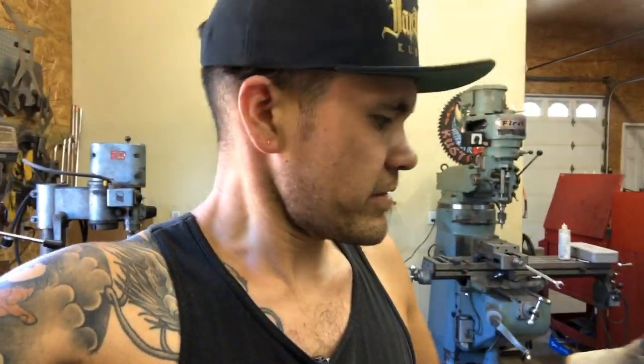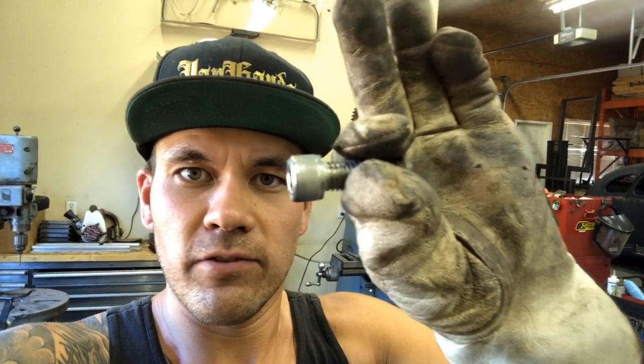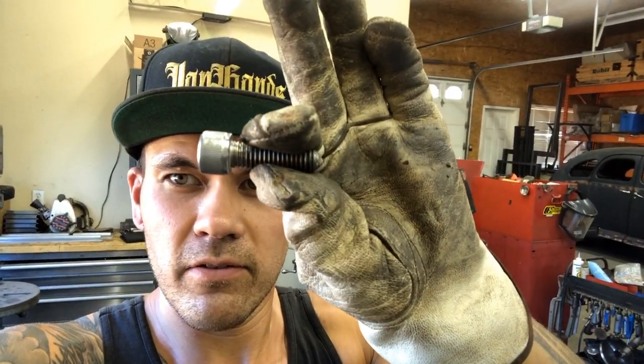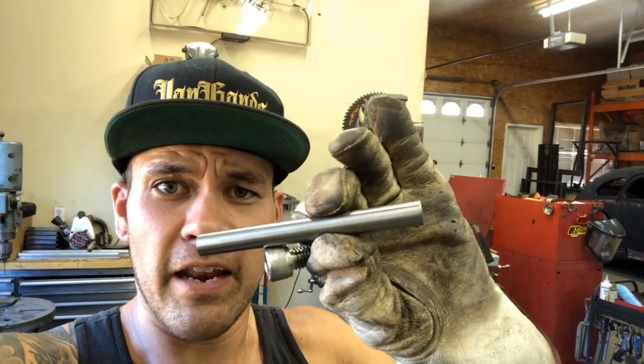The next step for me, I think, is I'm going to make a cool little twister nut for this side, just using a stainless steel cap screw. I'm probably just gonna lathe down the knurl on that screw. I don't know if it's gonna actually focus on that so you can see the knurl, it doesn't matter. I'm gonna use another piece of that half inch stainless. I'm gonna make basically just a giant wing nut. That's all it's gonna be. It'll probably give it a little bit of a bend. So it's kind of like a wing nut like that. That's what I'm gonna do next.